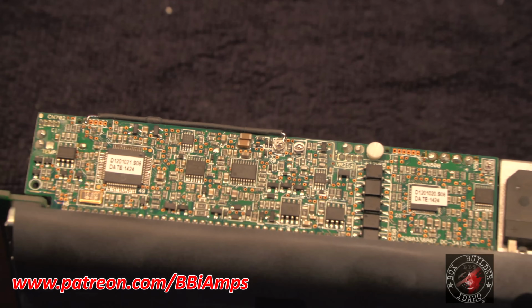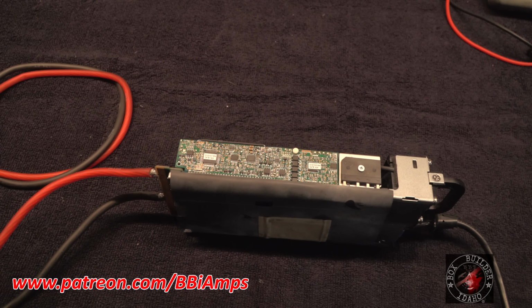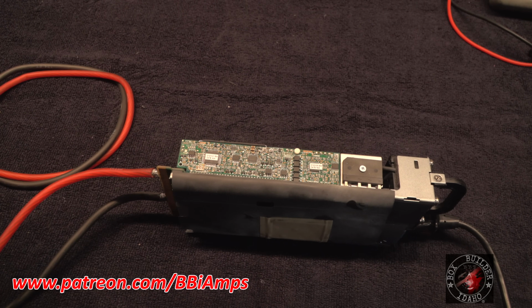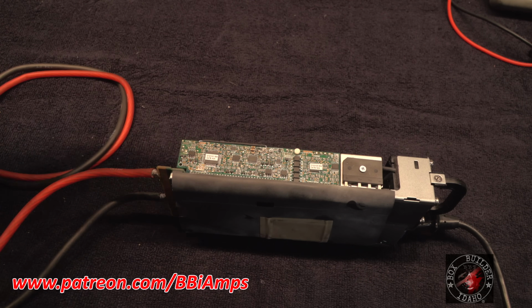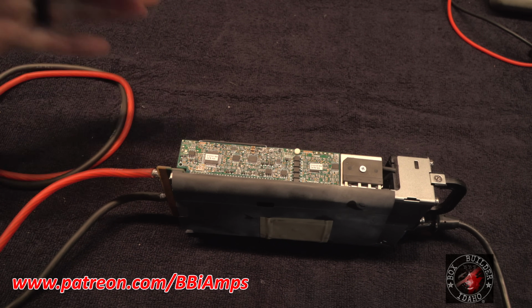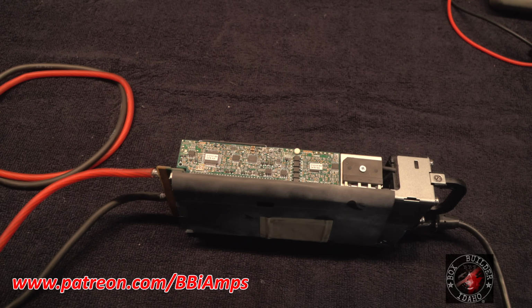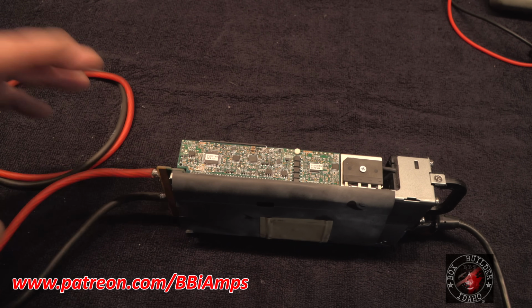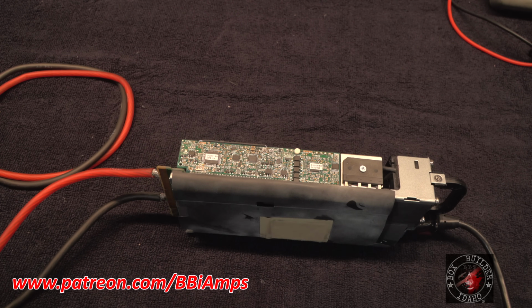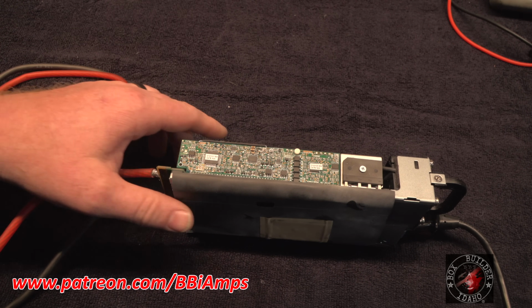The crowbar protection is the hardest thing to fool in this power supply. Very, very sensitive. Like you guys saw in the last segment, where I'm moving the load on and off of it, and it would just clip out. Well, today I came out and I said, okay, enough of the carbon pile. Let's actually hook a 2-pill up to it. I could not run a 2-pill on this without it going into crowbar protection. I couldn't. It was too damn picky.